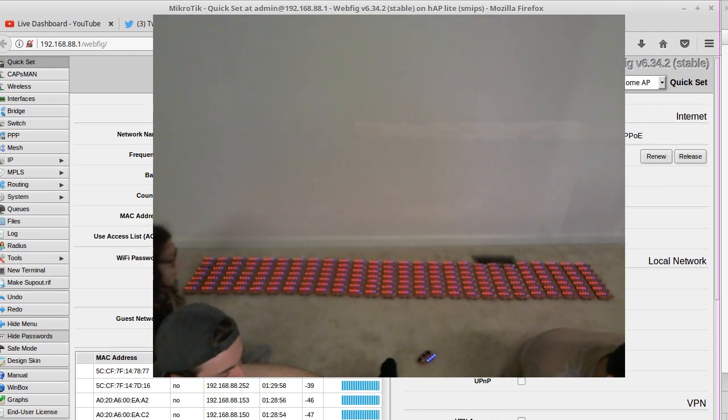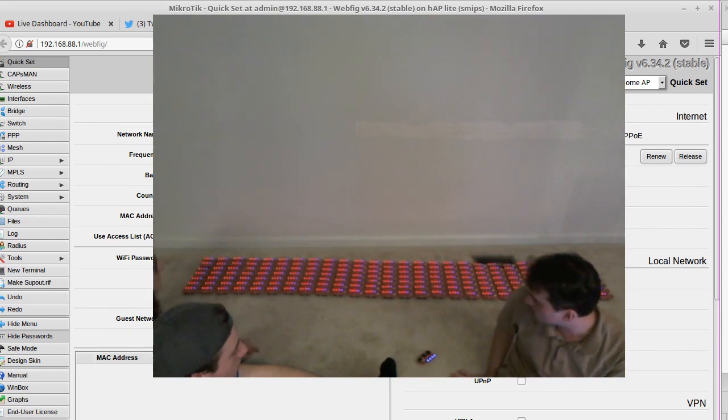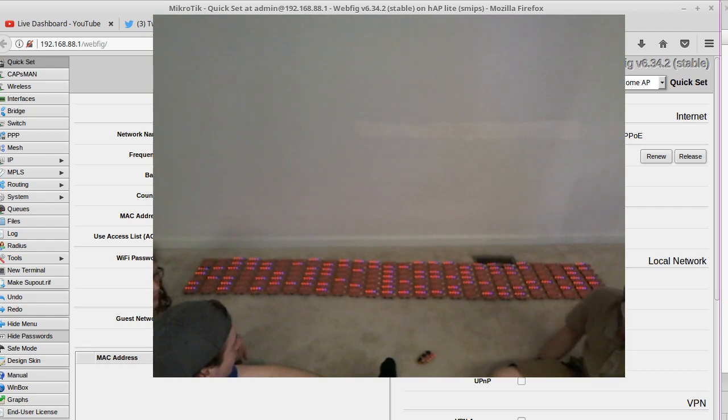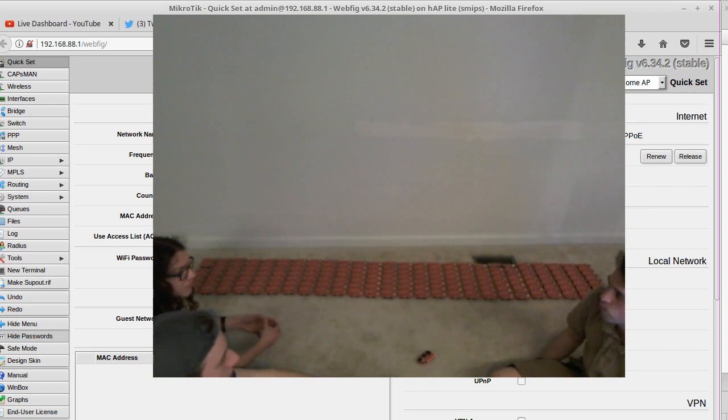but I will rename the network. So now all of the badges are going to slowly realize that they're not connected anymore. And so you'll start to see them drop offline here a couple at a time. And what they're doing is they're going into a power save mode where they use 0.3 milliamps. So they could literally last weeks and weeks in this mode.